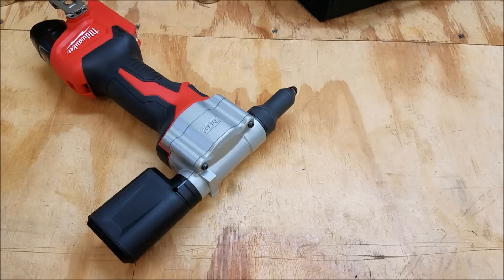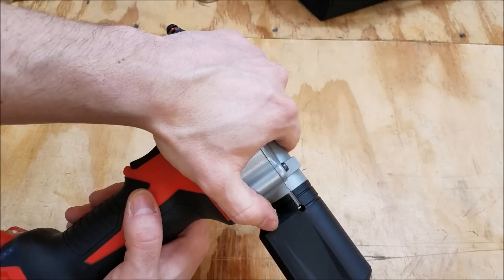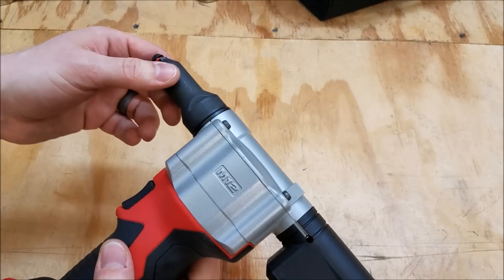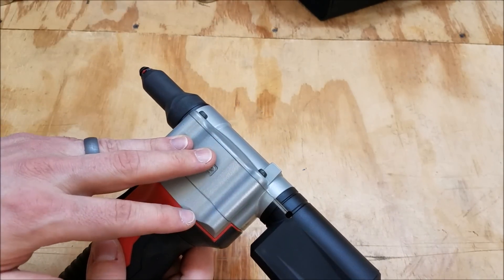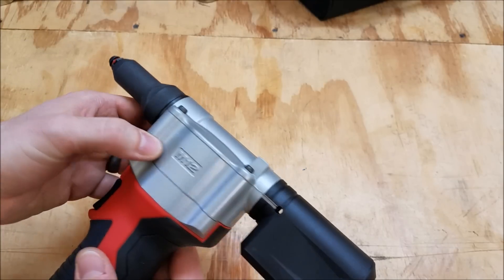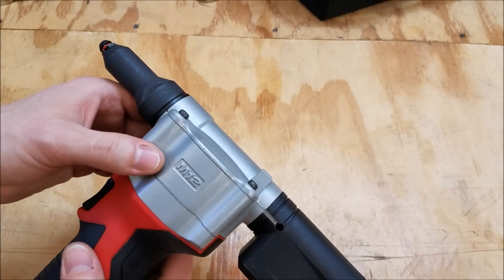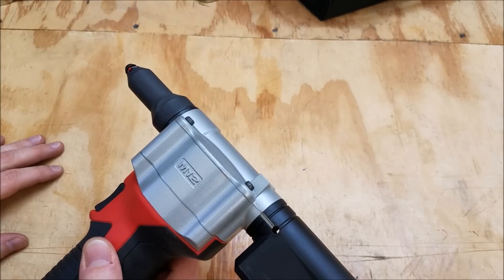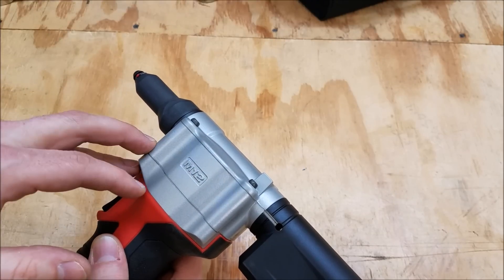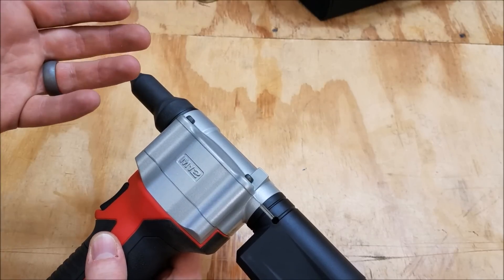Just a hair over nine and a quarter. It's a pretty hefty tool at four and a half pounds, but it's built really beefy up here — it just feels like it's built like a tank and I've had no problems with it performing at all. It's got a lot of power, in what I'm assuming is either a worm gear or a huge epicyclic gearbox with a lot of reductions to get all that 2000-pound pull force out of it. It does have a 0.8-inch travel, so you should be able to do a wide variety of fasteners with pretty decent-sized grip lengths.